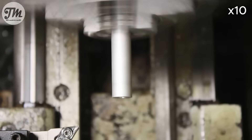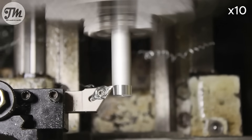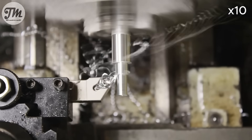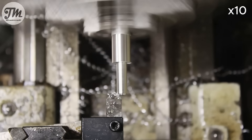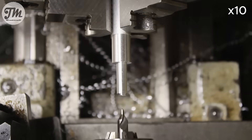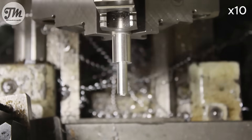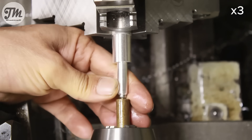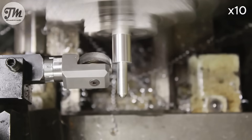For our balancer to work correctly, the entire base plate must be perfectly level. To achieve this, I'm going to add three adjustable feet screws. This classic three-point design is the best way to ensure a stable and perfectly level platform. A flat foot on a flat surface can still rock, but a ball on a flat surface creates a single point of contact. That's why I'm installing a steel ball at the end of each adjustable foot screw.